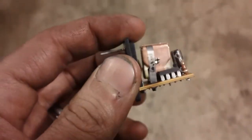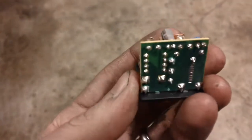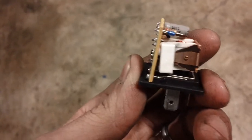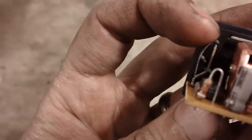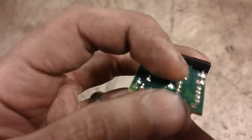Relays are normally very clear to identify. This one smells like a burnt campfire — like a fire put out with water or a candle that you blew out. And if you look over here, you can clearly see the damage right there: there's a little piece of metal that's burned. And not only that, if you look over here, the contacts are burned for that component as well.